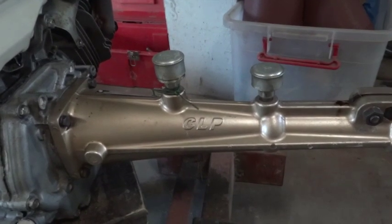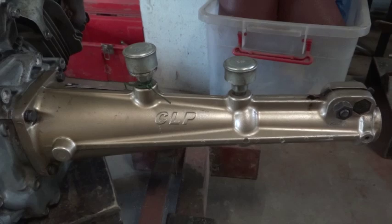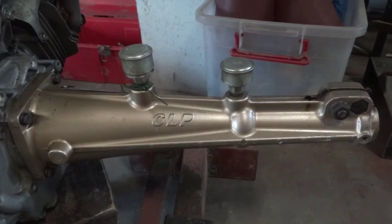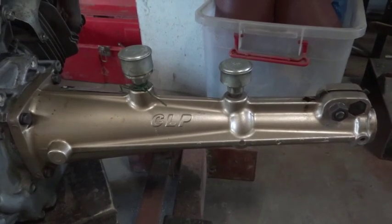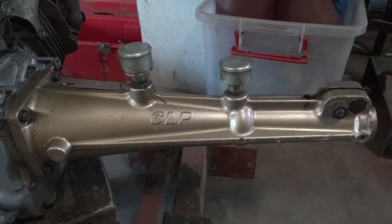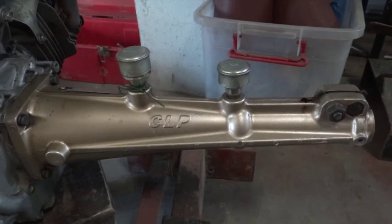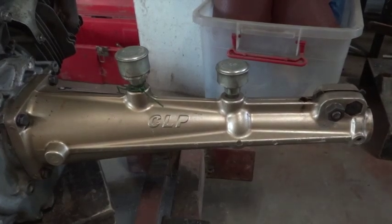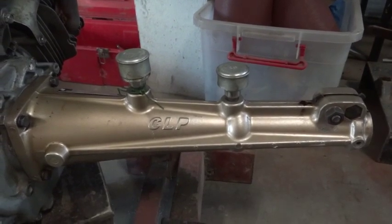I wish I could show you that bearing, but I've never seen it — you've got to take it all apart to get at it. I've had this setup for seven or eight years now and haven't had to take it apart. These setups frequently last the life of the engine, which could be 10 or 15 years or even longer. So this is the best setup you're going to get, and I really advise you not to change it. I've seen people put a universal on the shaft to make it bent — they think they'll gain something, but they lose. The boat won't be balanced, and the thrust of the prop will push the handle down on the tiller.